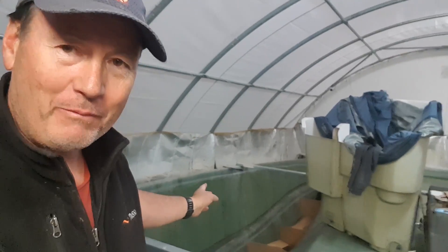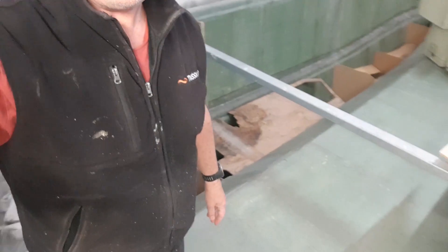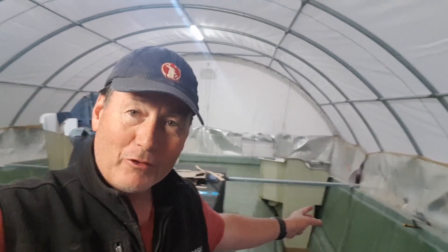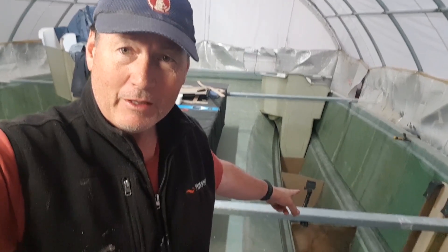I've seriously had a good couple of days. As you can see up here, I've been able to install the templates for my bulkheads. I've got all the shapes done with my chain jig — it's been an absolute winner. I've even got the floor template started here, which is an old one I inherited, so I'll be making a new one. Up in the starboard end, we've got the forward head — I've been able to put the crash bulkhead template in place. A little bit below that is the second bulkhead from the bow, and then we have another one and another one. Remembering these are only templates — I'm going to lay them over foam, cut out the foam, glass the foam, and then install and tab them in place. The thing's starting to take on almost a three-dimensional effect.